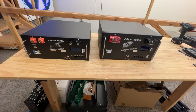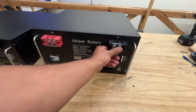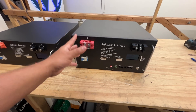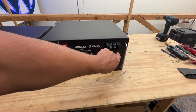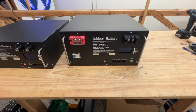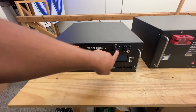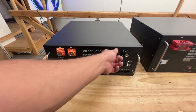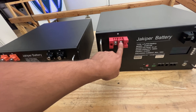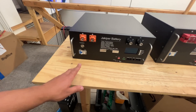First, the external differences. On the sides are the terminal posts — they have two because in many of these systems you can stack batteries together and daisy chain them. So you have one cable coming from another battery and another cable going to the next unit in the chain. On the new version two, the terminals seem better quality and bigger — M6 instead of M5 — so they're a bit beefier.